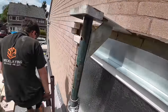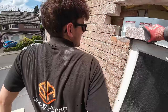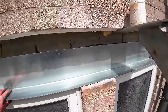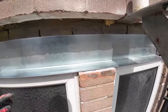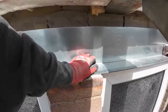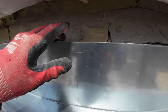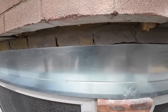We've got to just adjust the seating at each end. What have you got there? Three quarters. Yeah, so I'm obviously bedded because it's rocking a bit. Yeah, that's it. Going to pack it over each window, and then this pillar's taking a lot of the sag out of it too, so we're going to slot the insulation down here now, our 170mm slices, then we're going to nail the tray up into that bed, and then we're away.